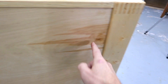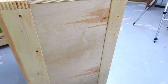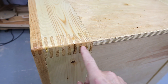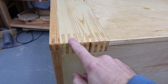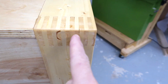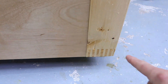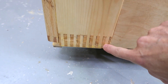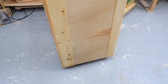On the back the gap is a bit bigger. I glued the front on first because I wanted to avoid a gap there more than on the back. I had a few gaps in the box joints because I didn't cut them super tight — just to make assembly easier — and I used my usual technique of glue and sawdust to add retroactive precision. But one gap you can still see; I must have missed that. And towards the bottom there's still a bit of dried glue I didn't even clean up, though you wouldn't notice unless you're looking for it.